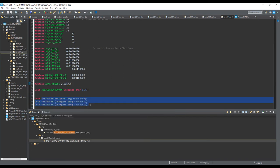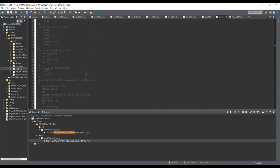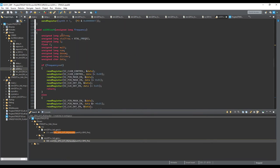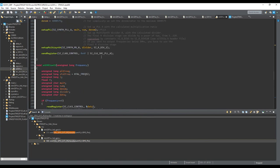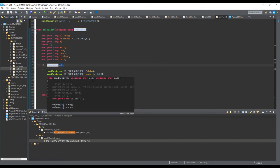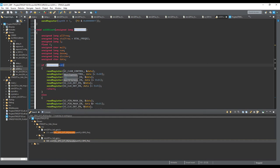So here I can set between those three outputs. And I did some modifications in this code, which is important to tell you. Don't care about that. Some related Arduino stuff, okay, but it's nice. So if you put zero here, it means you don't want to transmit anything in this output. So be careful. If you are using those three outputs, you have to do something like that. So read this register and set the information of the register.